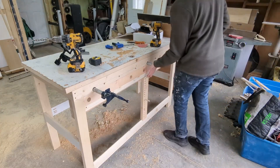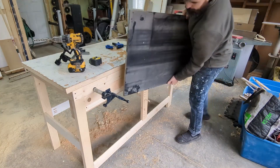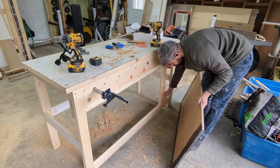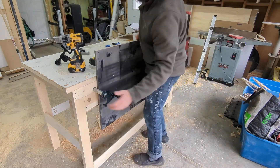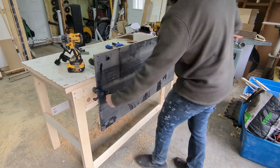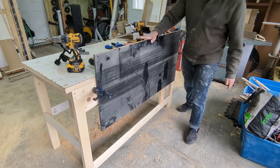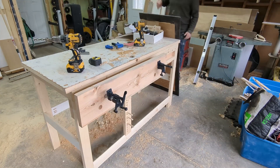Finally, it's showtime. It's probably pretty obvious how to use the vise with the jaw, but I'm going to show you a couple other options with these other supports we added and the sliding dead man. First, we can actually remove the jaw totally if we want to clamp a large panel to the bench. You can position the dead man near the end of the panel and put a dowel so that the panel is at a comfortable working height. Then, with just one clamp installed, we can clamp the panel in place. This is sort of a low budget leg vise setup — it will work great for edge banding, sanding, or drilling operations on the edge of a panel.